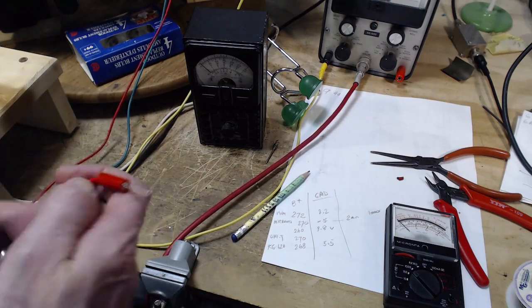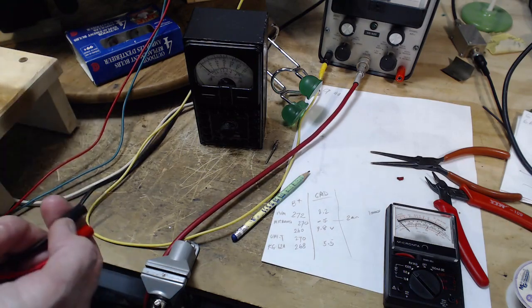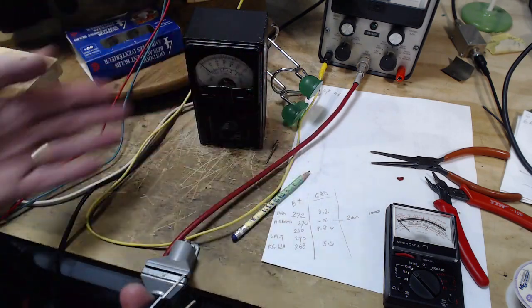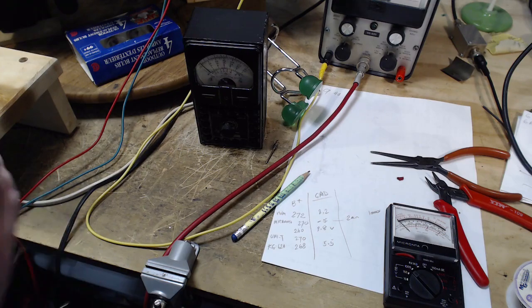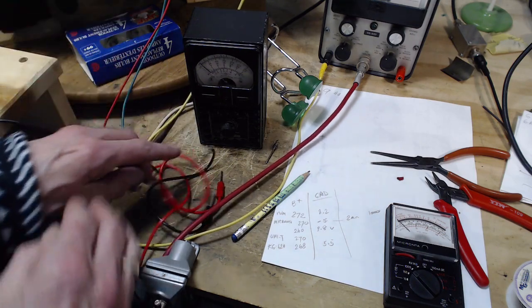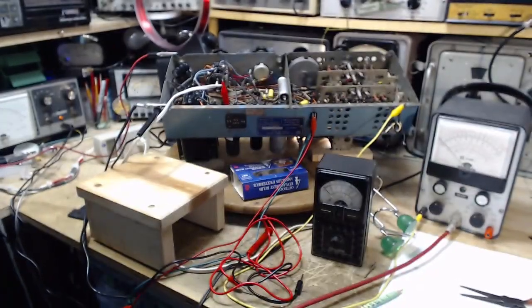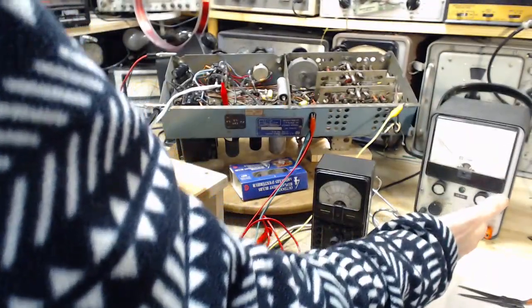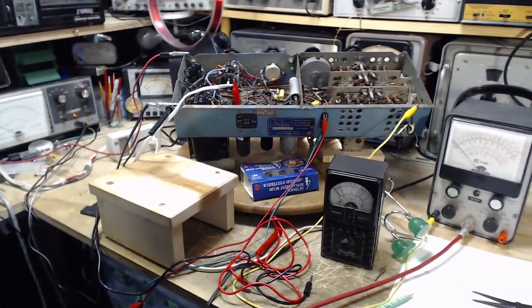Kind of lost it. So we've done the high impedance and the low impedance measurement. We found on the low impedance power supply measurement, the higher voltage meters are all really quite accurate. And we found on the grid test, which is the high impedance test, that the meters were ranged. But surprisingly, the one that seemed to do the best is the one I use all the time, which didn't seem to load down the circuit. Now let's pursue this a little bit here. This meter seemed to load down the circuit, and this one didn't. But they're both vacuum tube voltmeters of similar vintage and quality.